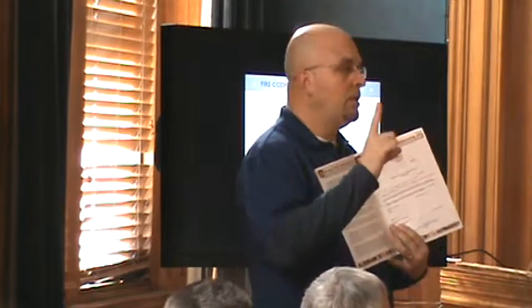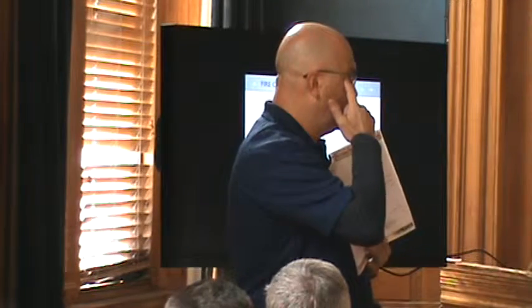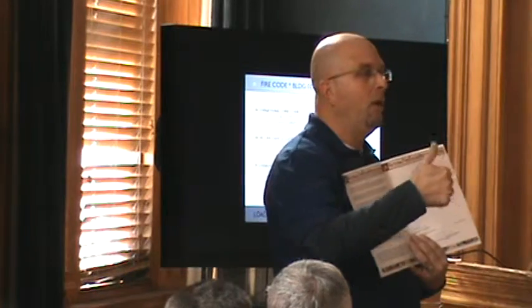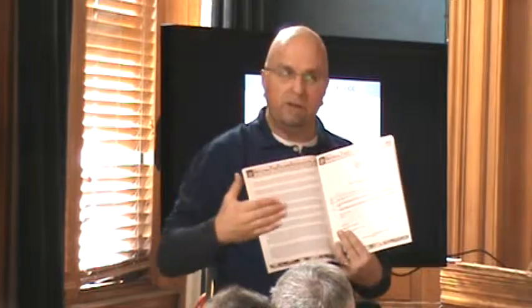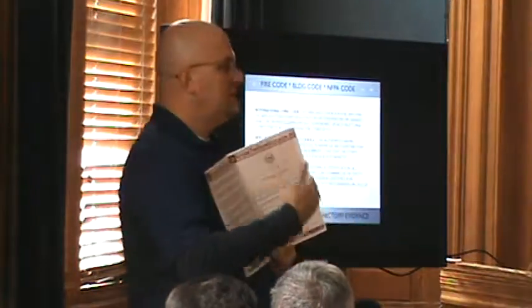The repair guideline doesn't mention welding. You can weld on a fire escape if you wish, but it can't have any lead, it has to be fairly new, and it has to be a certified welder. One year later, in order to meet the requirement — what happens to a welded connection that water and moisture got into and the guy didn't seal? It's suspect. Do you need to radiograph it or load test it? How about a bolt put in today — five years from today, can I provide you other evidence of strength that five years ago this was a brand-new bolt? The other evidence of strength on a properly maintained fire escape will avoid the load test for 15 to 25 years.